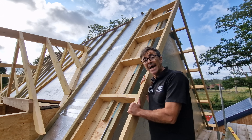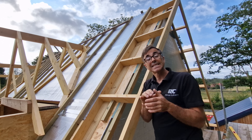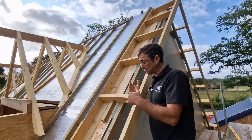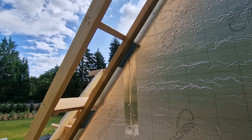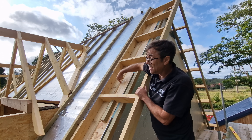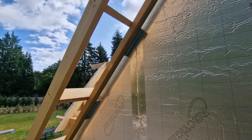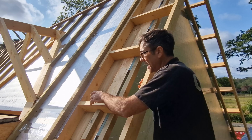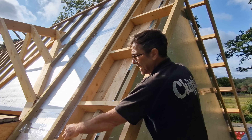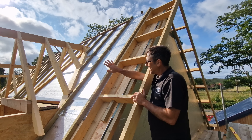Let's look at how we deal with the gables. With 100mm PIR all the way over the whole surface, the idea is to keep that as seamless and tight as possible. We also have to take into consideration junctions that meet other insulated sections. In our case we're using the same method on the gable walls — you can see the structural stud, the 18mm sheathing for bracing, and then a plate of OSB which comes up underneath tight with our insulation on the wall. That gives support to the gable ladder, which hangs out and is the same height as the insulation. We also insulate in between all of these before putting our membrane over, because that area would technically be a cold spot.